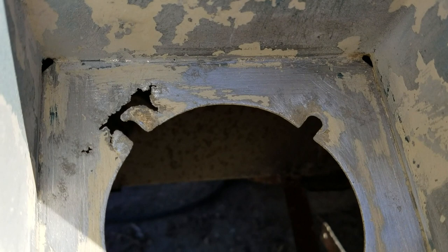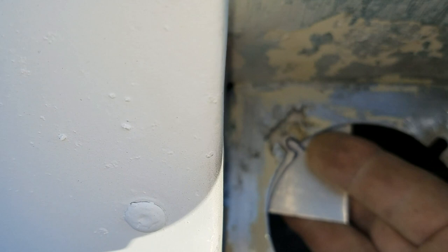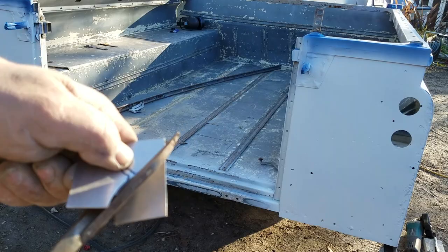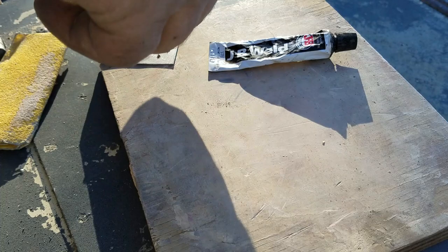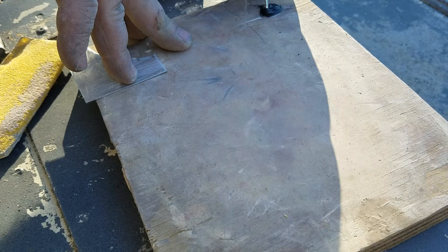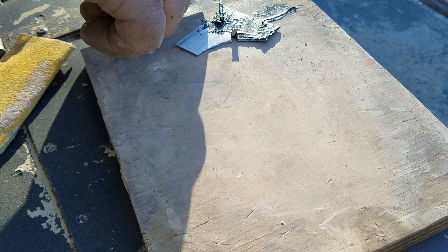There's a little bit of corrosion. Yes, aluminium does corrode — it doesn't rust but it does corrode, especially where it's touching a dissimilar metal. So what I've done is made this aluminium patch. I'll nibble that out and I'm going to use my old favourite JB Weld to attach it. I'll sand it up with 60 grit sandpaper. The JB Weld is an epoxy paste that has a black part and a white part — you mix the two together until it becomes a uniform grey colour and then splodge it across anything you want to repair or glue.